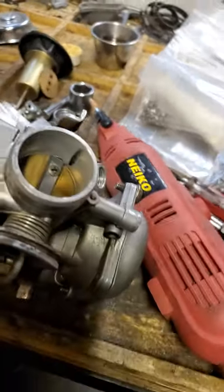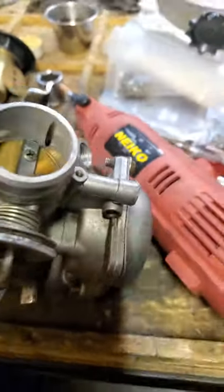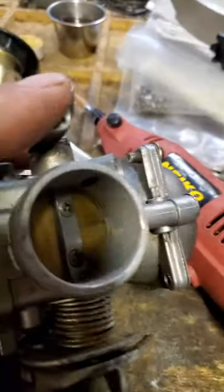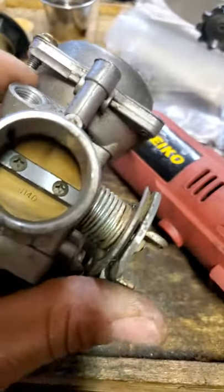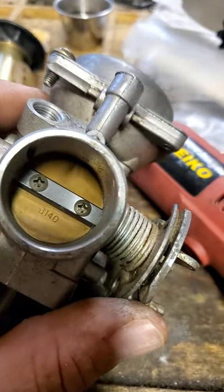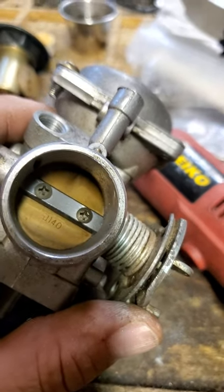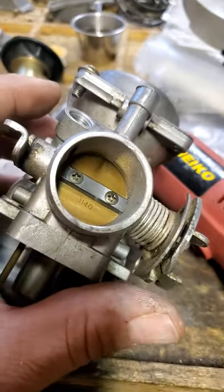The next step: I also have Japanese industrial standard screwdriver bits, because American standard number 2's are too small and number 3's are too big. You run the risk of stripping these out if you don't use the correct Japanese industrial standard bits. I bought three different sizes and it cost me about $100. I use my impact driver to take them out.